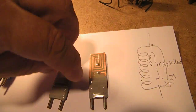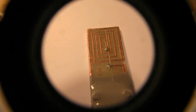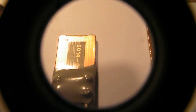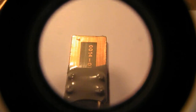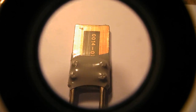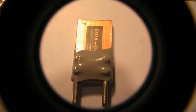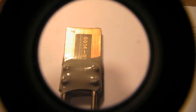Here again, two coils. When we go to the very high frequencies, radio coils can look very different. Here for instance you see coils for a high frequency, and in fact this looks a little bit like a hairpin, and really when we go to 400 megahertz or 500 megahertz, coils look like hairpins.